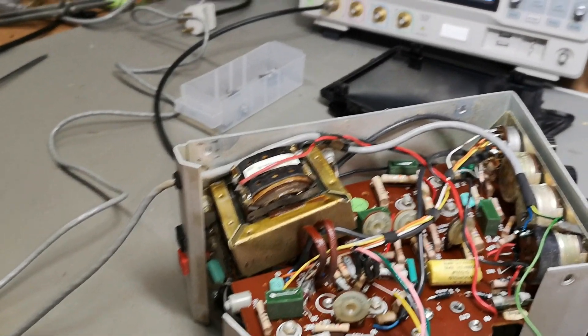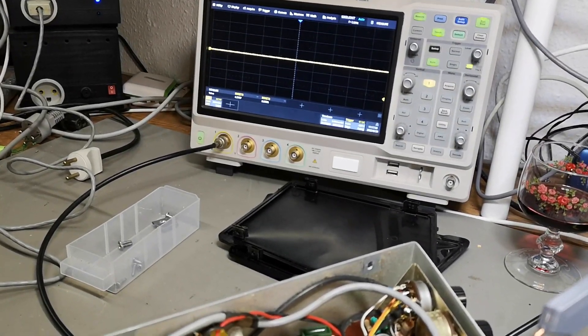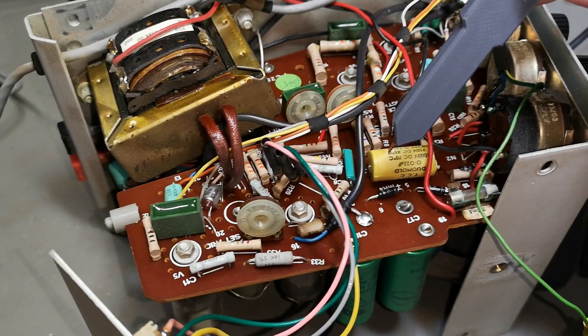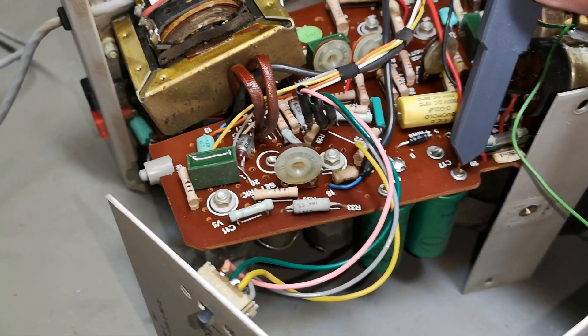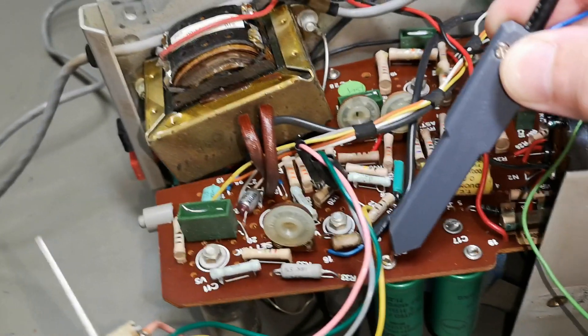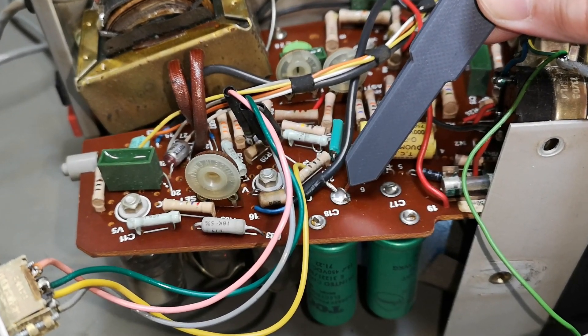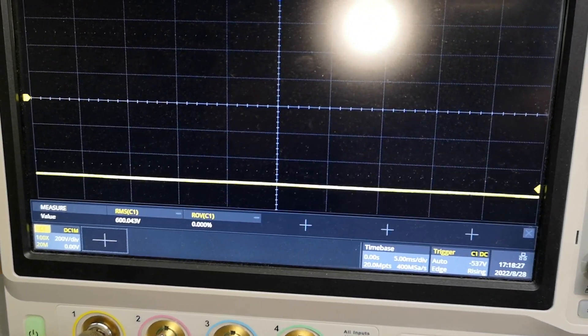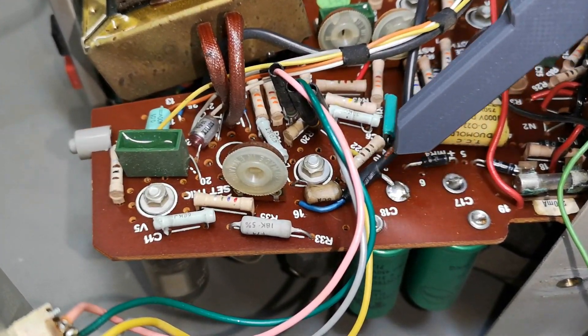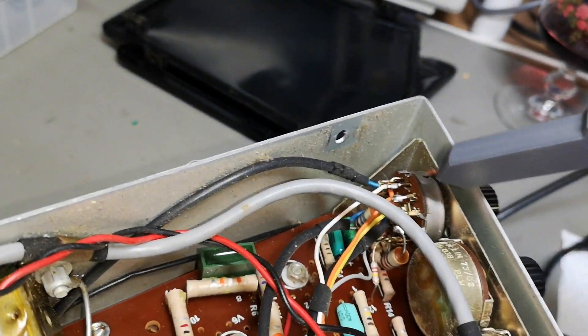Let's measure a little bit inside the high voltage. I'm using my high voltage probe at 200 volts per division. This one is minus 41. Minus 320 here, and this is also minus 320. And here is minus 600. The minus 600 for the cathode looks actually quite clean. So this is minus 600, and there's a coax that goes all the way to this switch — this is the time base switch. Is that good for this kind of isolation?